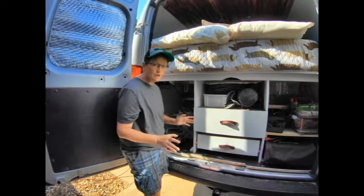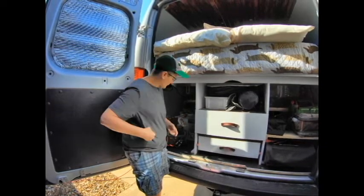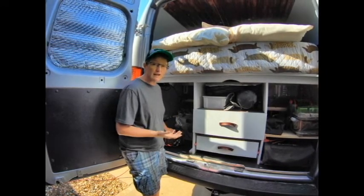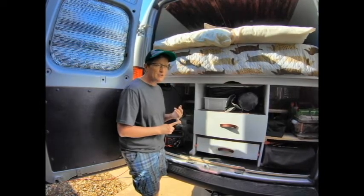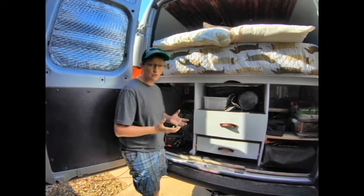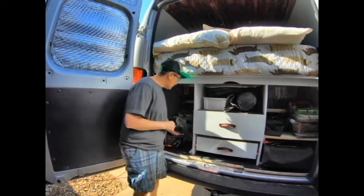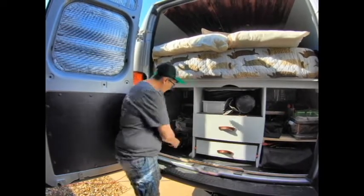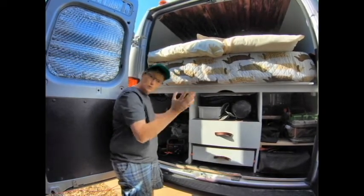When I'm completely off-grid, I've got lights, water, drain, and the fan. When you're only running the Jackery 240, if you've got everything on it really only lasts about eight to ten hours depending on what you're running. One thing I do is make sure I don't run my fan at 100% because that pulls extra wattage — I put it at about 60% and that's perfect for us. The good thing is if you're on shore power, you plug the Jackery in and it stays constantly charged while you're running all your equipment.